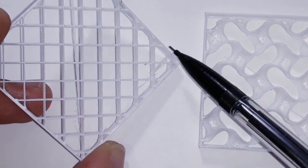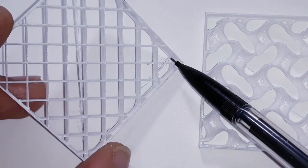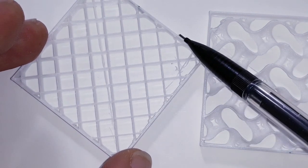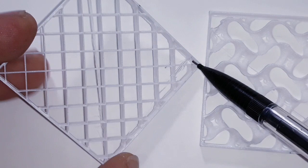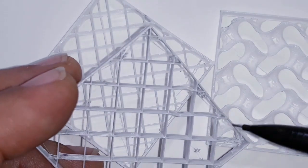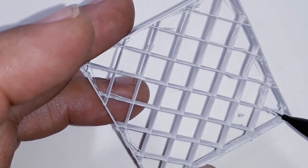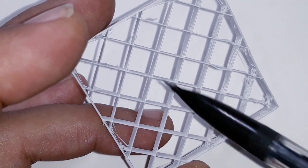A permanent solution could be implemented if every time the head jumps to start an infill line, it does a prime of material — similar to what happens after retraction. When the head retracts and moves, there is always some oozing and loss of pressure. A setup where it primes a little bit of plastic before starting to print would create that pressure and eliminate the problem. This would allow use of non-connected infill walls, using less material and potentially less print time, though the head still has to travel all the paths anyway.